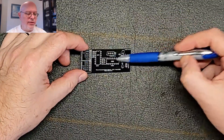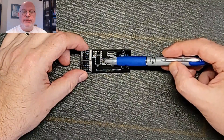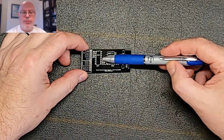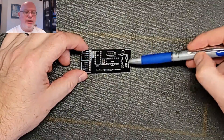This board also has a section for inverting the video, so depending on your machine you might need to invert it. You can put a jumper here and move it to either normal or inverse depending on your needs, along with the output for the composite.